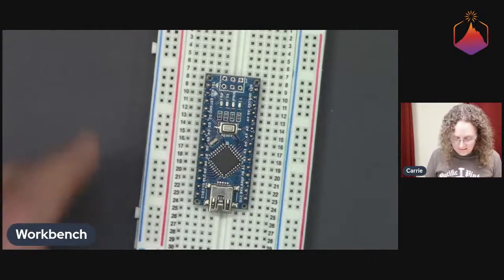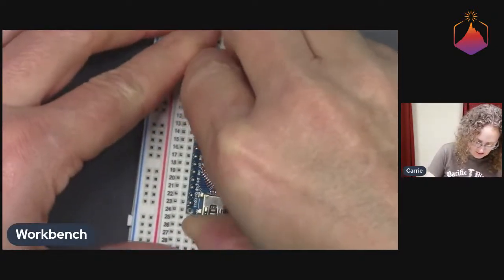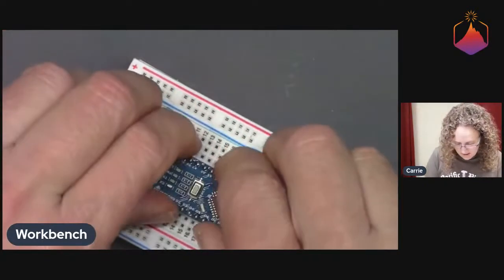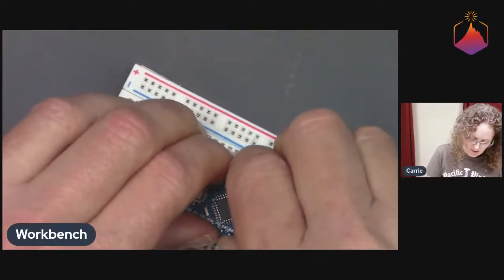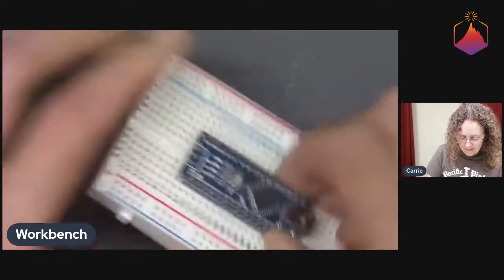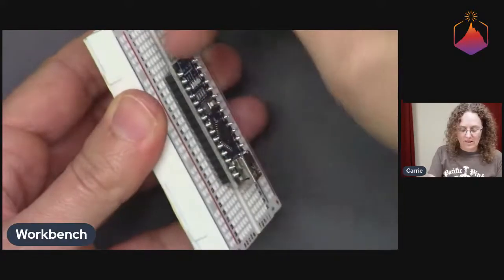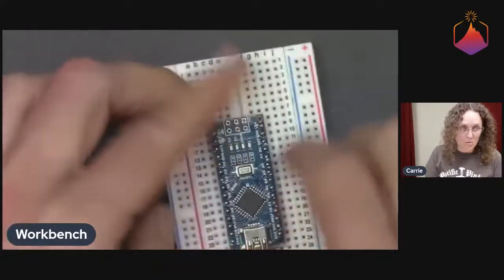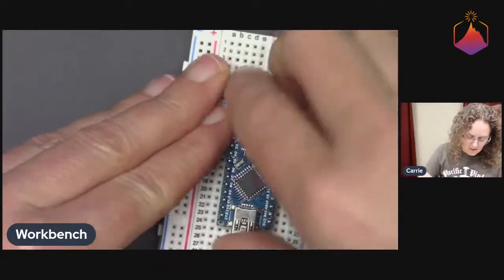All right. So now we are completely soldered. Ooh, and now there's a lot of friction getting these guys out because there's a whole bunch of pins and it's a small part. So we're gentle, well, firm, but careful. You don't want to just pull it out by one end, because if I were just to lever it out this way, it could bend the pins that are in this side. So you want to just wiggle it from side to side.